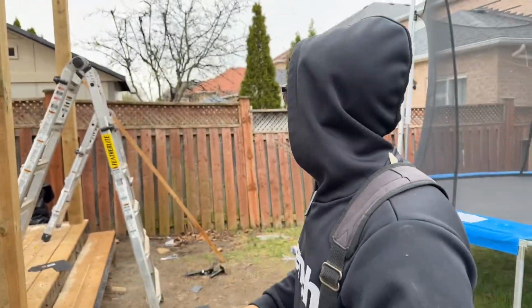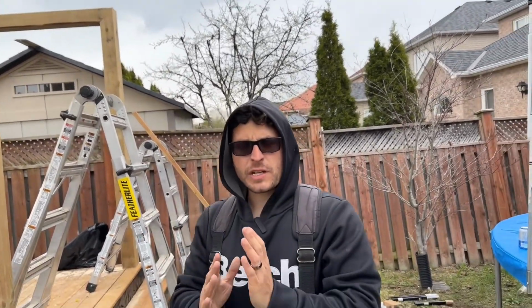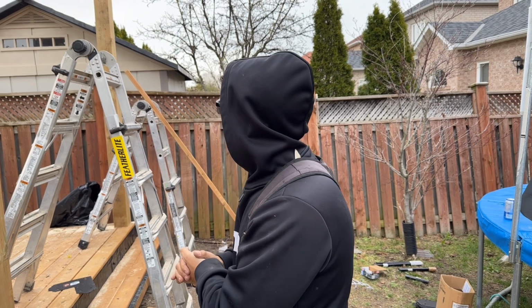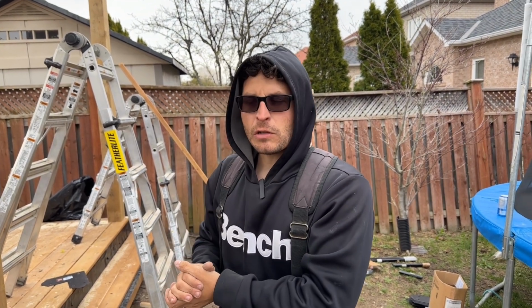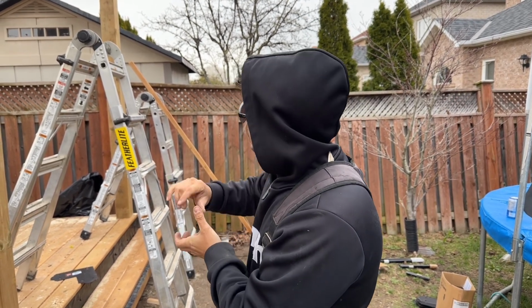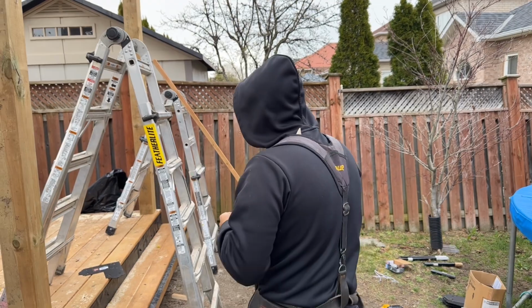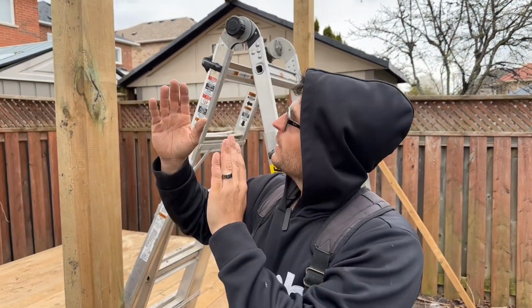Okay, so the original Beat the Bully pergola. We had a 2x6 running across the face and across the back of the face sandwich, and that was our structural beam to hold all those members up. One thing I do agree with the judges on is it looked bulky and a little too commercial. So what we're going to do now is use 2x2s in strips of three and space them out to give it that more decorative look. One thing they said was that the underneath was open, and they suggested maybe covering that up. But I think we'd just be building a wooden trough for rainwater at that point. So I have to disagree with that, but we're going to keep going, see what we get in terms of the appearance, and make this thing look the way I feel it should have.